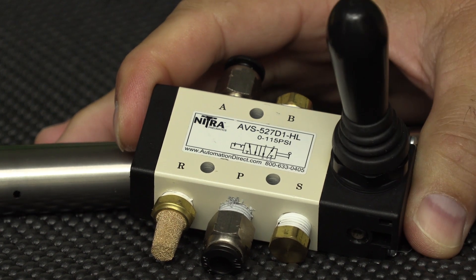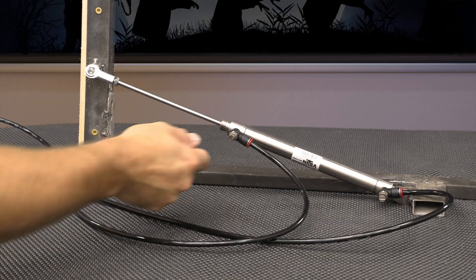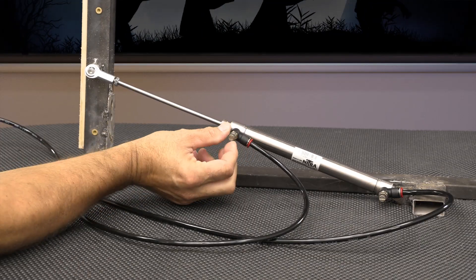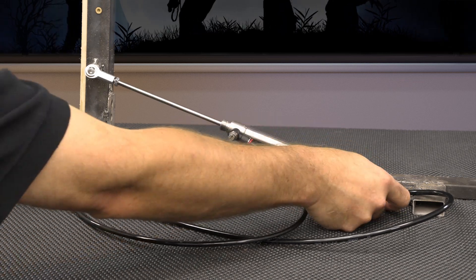Most of my previous videos explain how to automate props with sensors and a PLC. You can do the same with this prop if you have the time and money — it really doesn't cost that much to animate when using AutomationDirect products. Once everything is operating, I can adjust the flow control valves to increase and decrease the speed of the air cylinder. It works great.